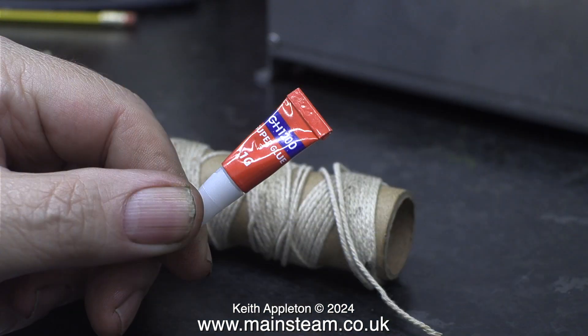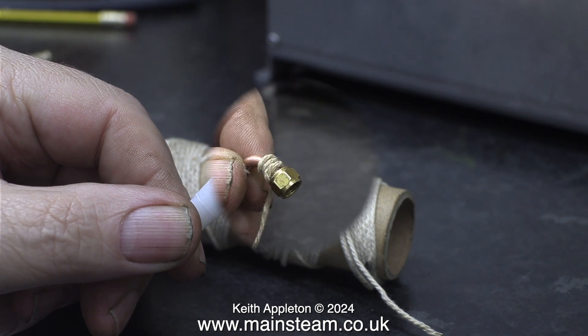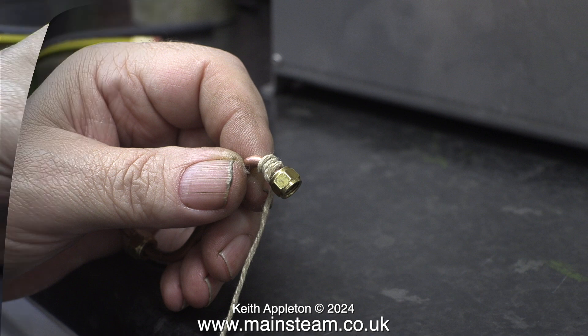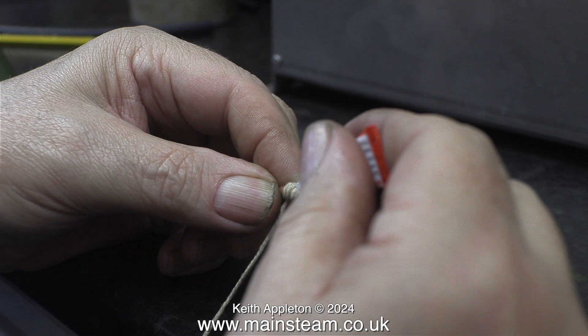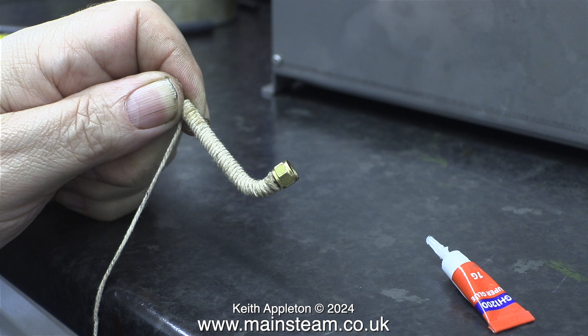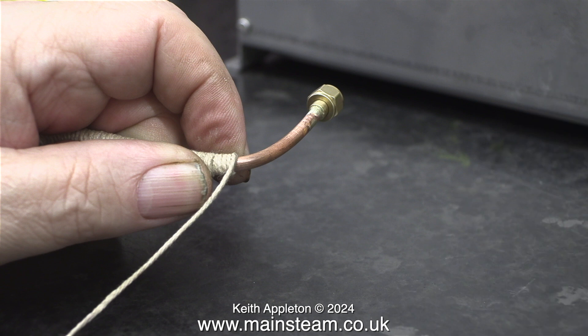Talking about string — this is what you need. This is not polypropylene string; that would melt. You need to select a material that will not melt when subjected to these high temperatures. Why the superglue? First you stick one end of the string to the pipe itself, and then you start winding the string around and around the pipe. Periodically apply some superglue — ordinary superglue, the very runny kind rather than medium viscosity, because it soaks into the string very well.